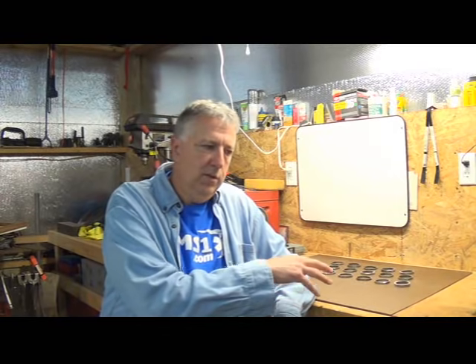I will use a hole cutter and cut the holes out of this hard board. I've measured these holes so that I can use my plasma cutter. I'm going to use this hard board as a guide for my plasma cutter to cut these holes out — we'll get to see how I'm doing that later on. I got that idea from somebody else on YouTube. I never really thought about using anything that could burn as a guide for a plasma cutter, but it does work.